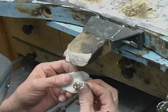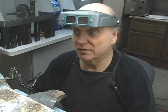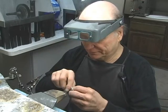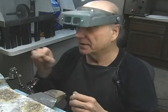So I do what I call my famous, world famous, but you probably never heard of it, paper towel trick. I'll take a piece of wet paper towel and wrap it around my stones so it'll heat sink them off. And then I use a very large tip, probably a number 6 or a number... I'm looking right now so I know. Oh, this is my 6, so it's not that one. I'll sometimes have to go up to a number 7.